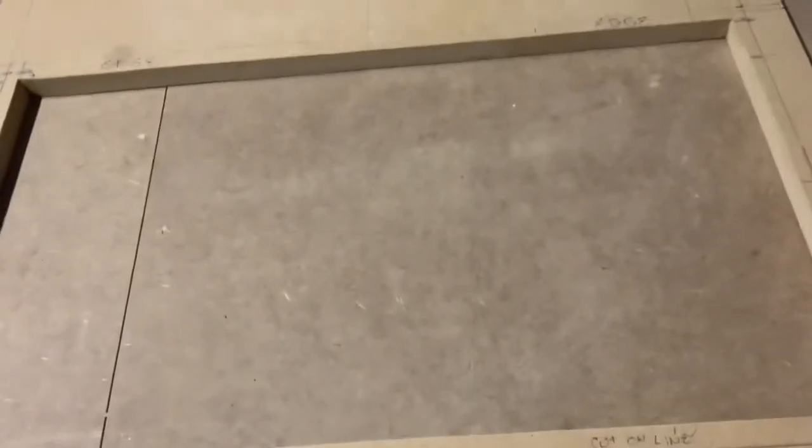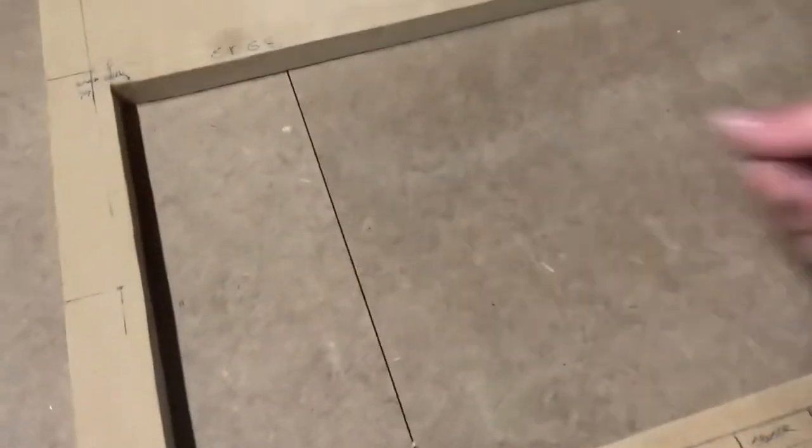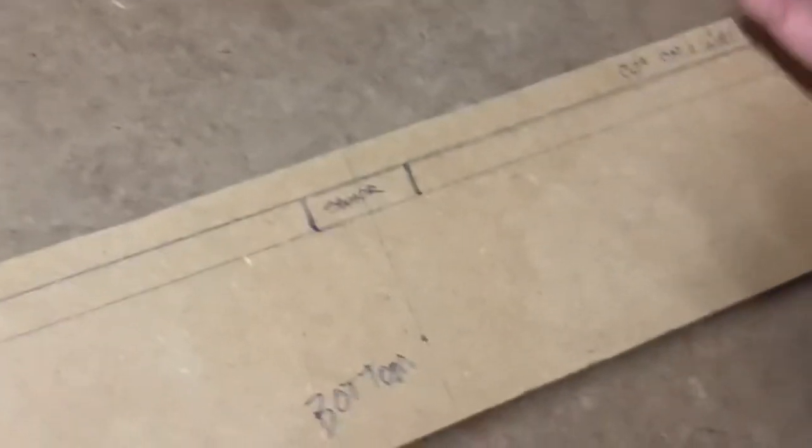Now, to cut out the middle parts, I drilled four holes and I was planning to use the jigsaw, but unfortunately the jigsaw that I have is cordless. So I got about 3/4 of the way around on the first one and I ended up having to cut the rest by hand. Then I decided, if I wanna get straight lines, I can put a brace down so I can get a straight line. Did some plunge cuts, which I hate doing, but I'm much more comfortable with them now, which gave me these really, really nice edges here. And you can see this is really clean.